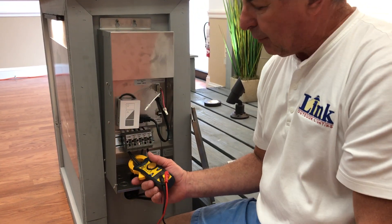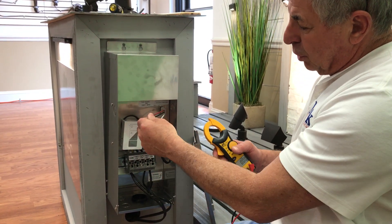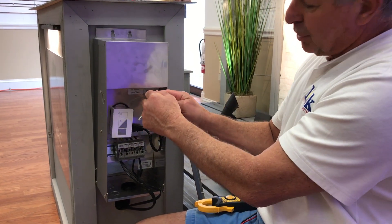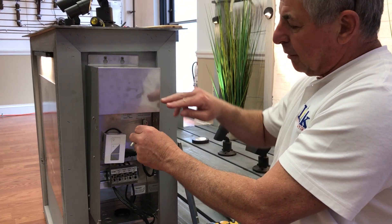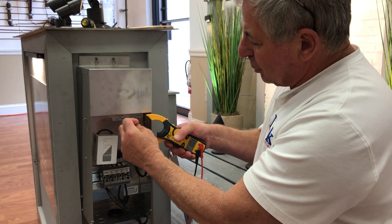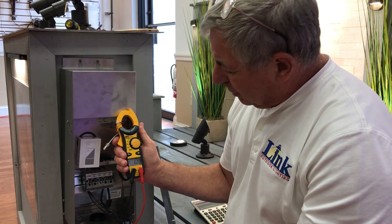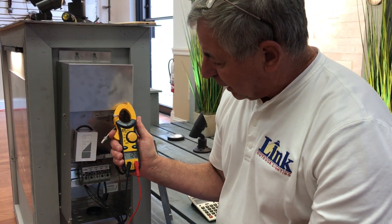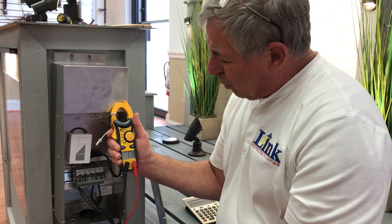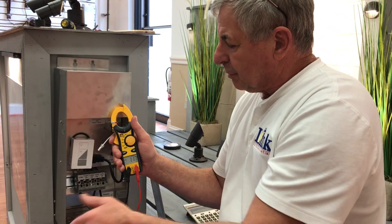Use your clamp meter and clamp the whole thing. Now the converse — same thing. This is a photo cell loop. We've got neutral, we've got a hot, and then a hot return back into the transformer, so we're not utilizing a photo cell — we're just inputting the hot side. This is only a break in the hot side, so all we want to do is clamp that one hot side. We're getting a lot of fluctuation here, but that's okay. It's a factor of 10 — we've got 1.1 to 1.2 amps on the primary side, factor of 10.